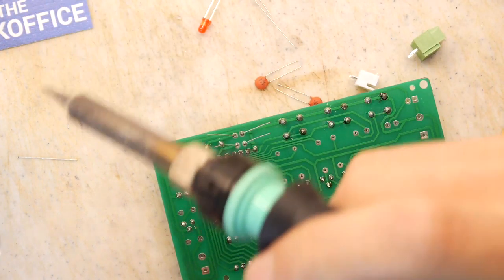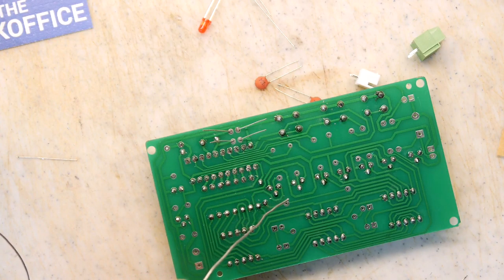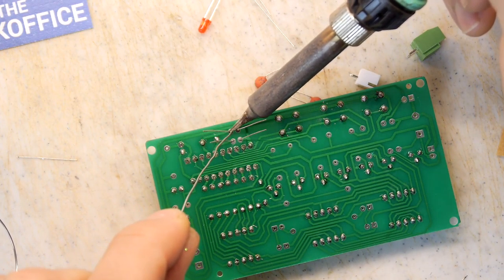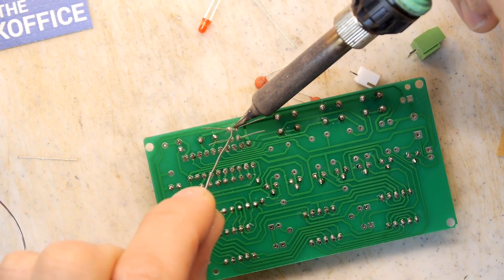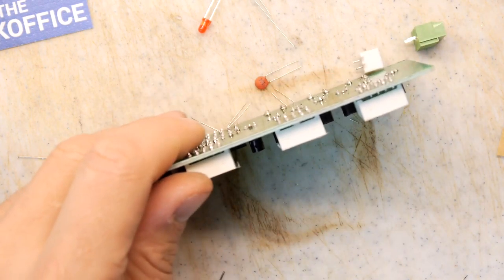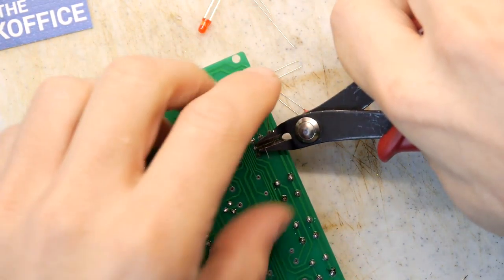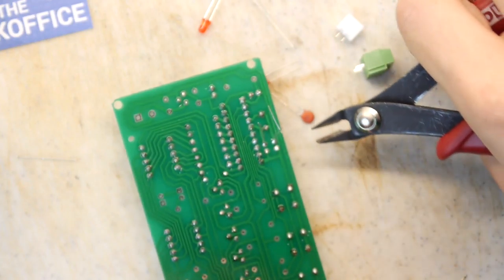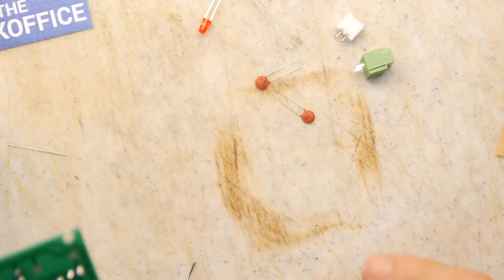They're probably there just to clean up the signal somewhat. You'll get these sort of weird effects in your circuits where your crystal won't fire. You'll notice there's no signal coming out. Pop something like that in and it might just work. That's usually the thing. The black magic of why it works is lost on me. 104 and 104.